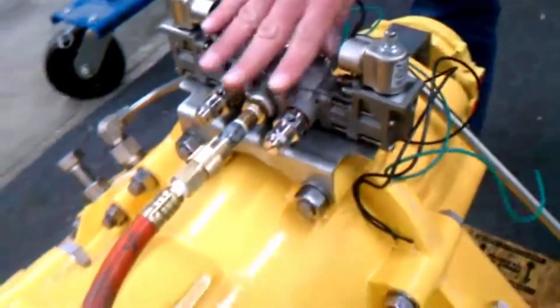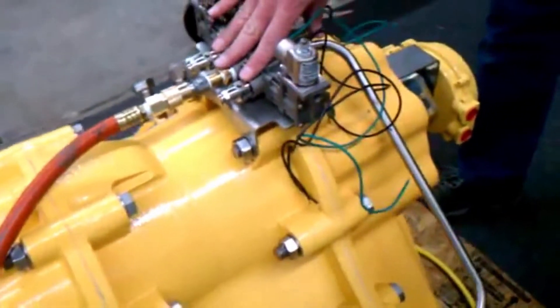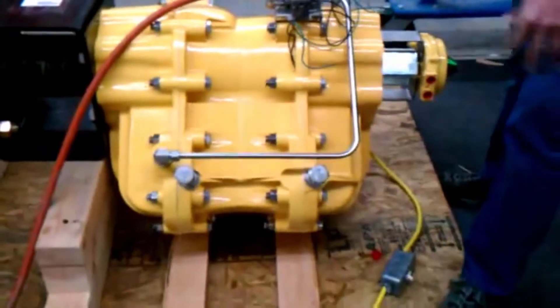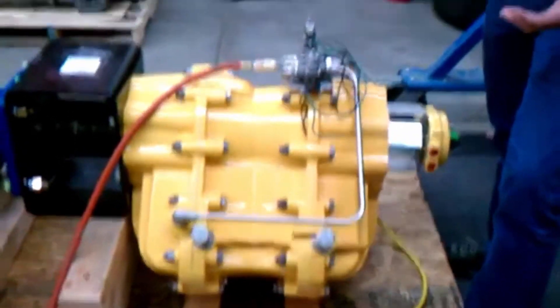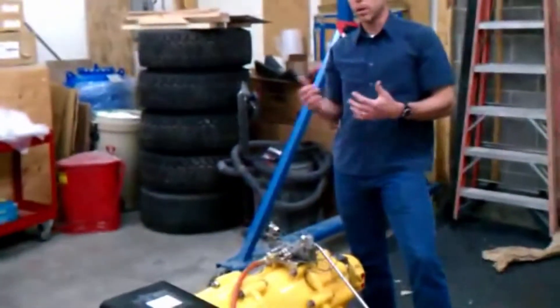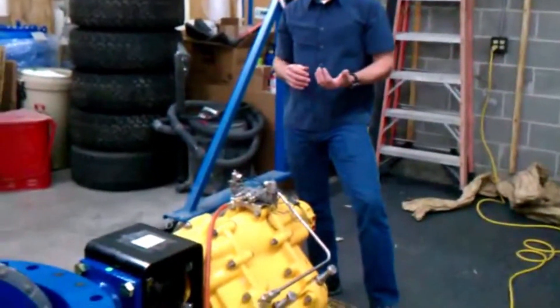For this particular assembly, we've adjusted the valve so the full stroke operation is about 60 seconds, and then at the end of the full stroke you'd like to get indication back at the main control panel if the valve is in the fully open or fully closed position.